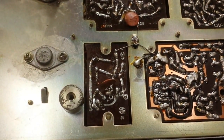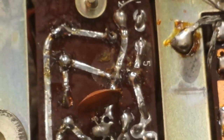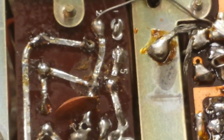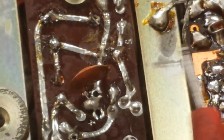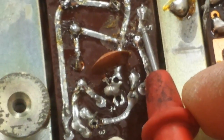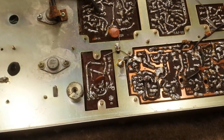Sure enough, I found the problem — I made a mistake. I severed a foil trace when I was replacing a capacitor. See there next to the number five. I was not getting any 20 volts to the regulator, and when I short it with my probe — there we go. Operator error. Let's fix the trace and then see how it runs.